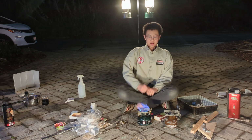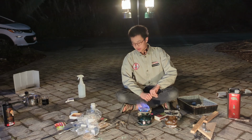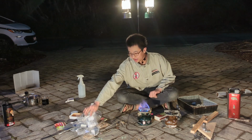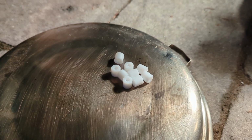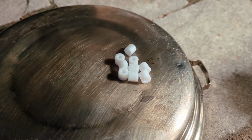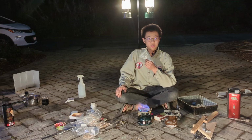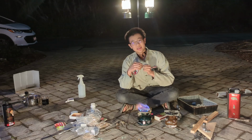Now, another thing you should consider before buying my part is that there are a few design differences between my part and Coleman's part. For one, I decided to go with the Teflon packing. A Teflon valve packing has a few key benefits. For one, it may be more durable. However, the graphite packing is already very durable. So that's not a big concern.